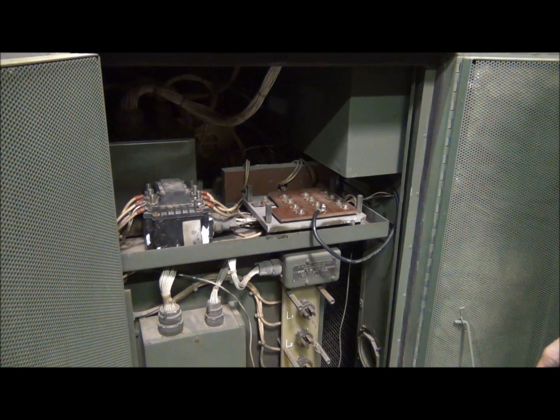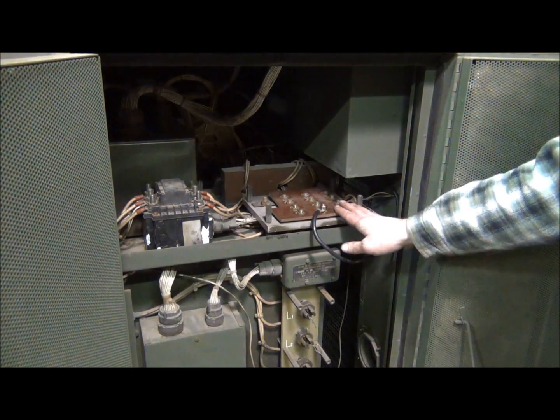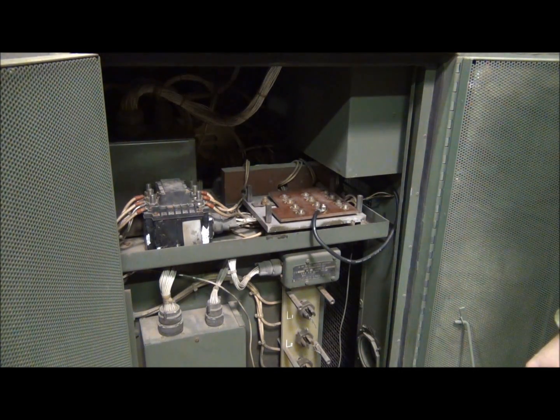Now that we've got the generator's 12 leads wired for single-phase, you could start up the generator and operate it this way and you will get single-phase out of it. However, because we've made some changes to this board, some of the wires underneath it that go to the generator's instrumentation and control systems are now going to see improper voltages. Several of the generator's gauges aren't going to operate properly — you'll get funny voltmeter and ammeter readings. The bigger problem is that the generator's voltage regulator, thermal watt converter, and exciter are going to be seeing improper voltages. So as you load the generator up, you're going to see excessive droop. On this particular set, it goes from 120 volts at no load all the way down to 90 volts at full load. You can adjust it back up, but the generator doesn't automatically compensate for changes in loads, so you don't want the things you're powering to see such a wide range of voltages.